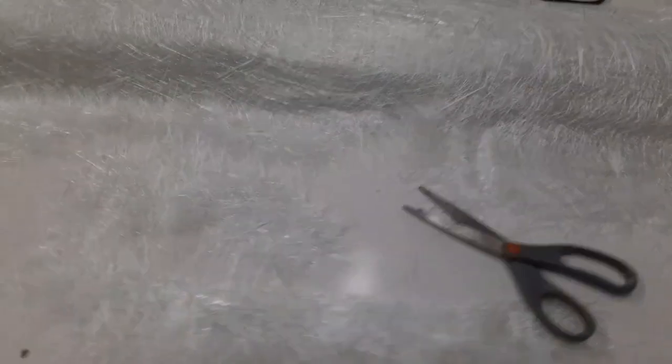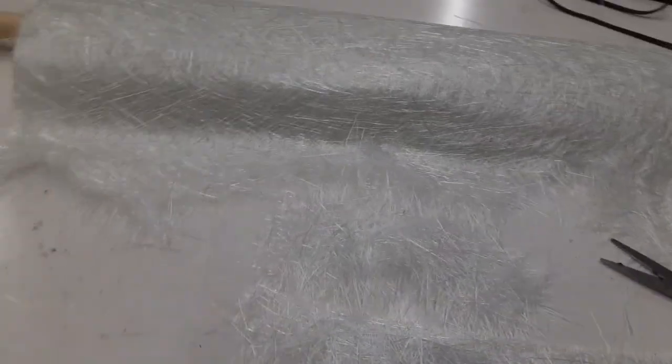I'm going to show you something real quick one-handed. I've already started prepping out my fiberglass mat. I tell you — never buy folded fiberglass matting. You never want a straight edge on a patch that's in the center of a vessel; however, on this one I do want straight edges on my repairs. So what I'm doing is tearing out my lengths — they're twice to three times as wide as what I need — and I am cutting them in a straight line with just a pair of shears.